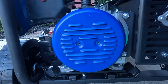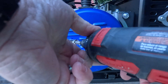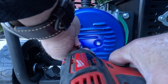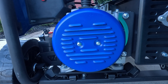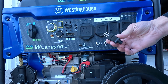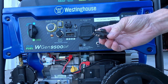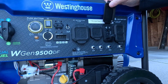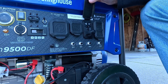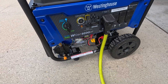Re-add those 7-millimeter bolts. If I ever want to use the generator for anything other than my house, I went on Amazon and got a plug that you can plug into the 110 outlet that will ground the neutral again temporarily. That plug has the neutral connected to the ground, so when you plug it in it makes the whole generator have a temporary bonded neutral again — so now I can use the generator with a table saw, air compressor, or whatever.